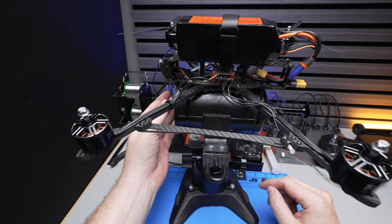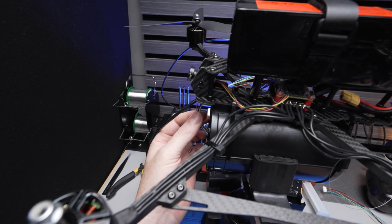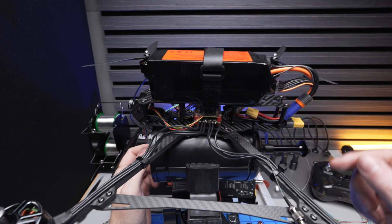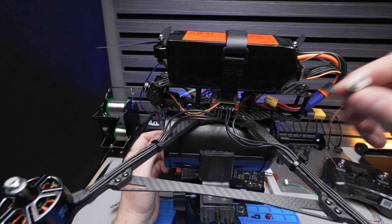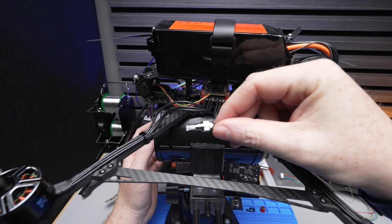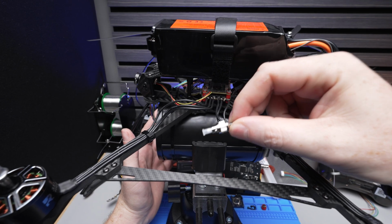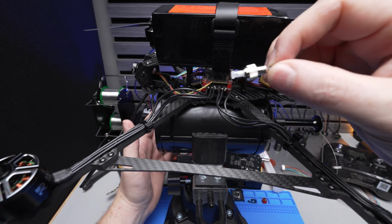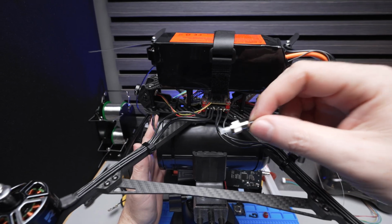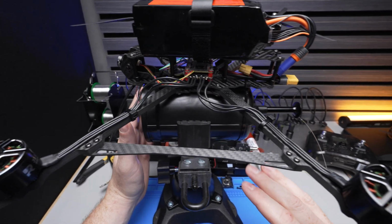But how it works is you have these cables back here, and they connect to the controller board up here, and then you have a fiber optic tether out. So this sends our commands, this sends how to fly the drone, this sends video out, and it can send other telemetry data as well. But this provides an uninterruptible, high-quality video that can be leveraged, and it is being leveraged.